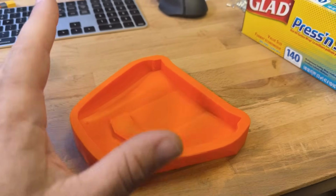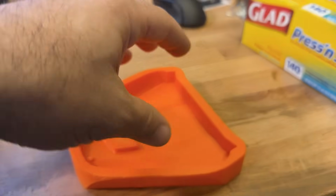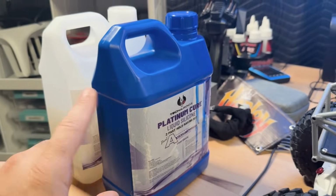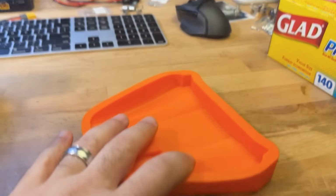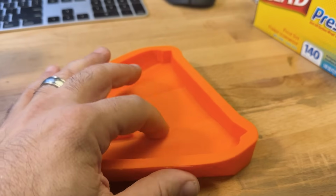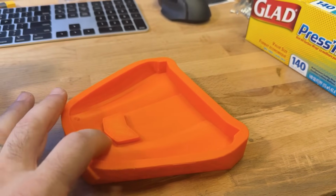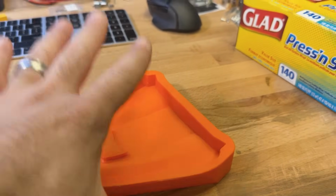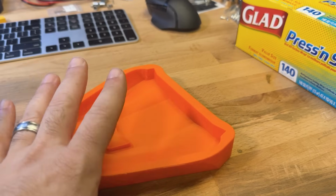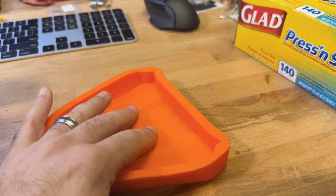The first step to doing one of these carbon projects is that after you have the finished mold, you need to make the silicone insert. And I use a 2-part silicone mix to do that. And when I put that in there, I feel like some of that may be getting left in the plastics and things like that. So I'm going to try and line the mold with some cling wrap and then pour my actual silicone in there to be formed up. And then we'll be able to take that out and I won't have that residual left in the mold.